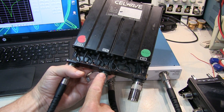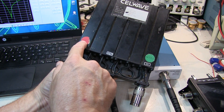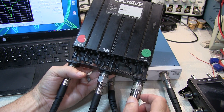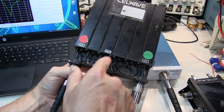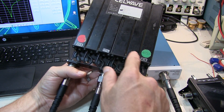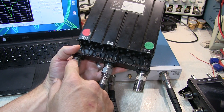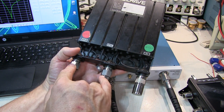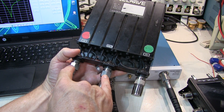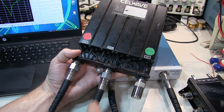The common terminal for the antenna is here, and we've got essentially our low side and high side — a little over 464 MHz and a little over 469 MHz. On the low side, we'll have high rejection of 469 MHz, and on the high side, high rejection of 464 MHz. We have the VNA hooked up between the antenna and the low side. So if we look at S21, the insertion loss or transmission coefficient, we should see a deep notch right around 469 MHz.